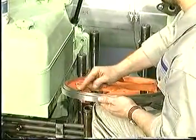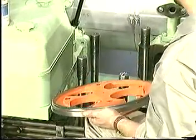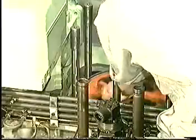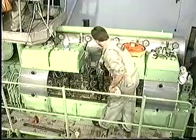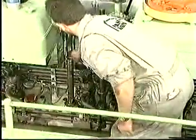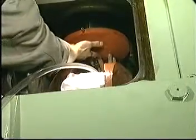Apply grinding paste to the grinding tool. Move the grinding tool back and forth, lifting it from time to time to allow the even distribution of the grinding compound. After grinding, clean the cylinder liner carefully and mount a new sealing ring. Remove the drain funnel.